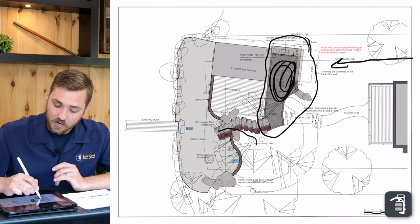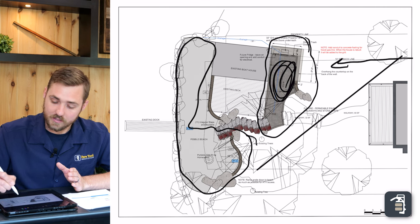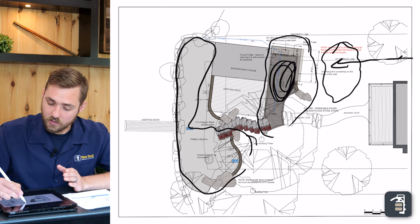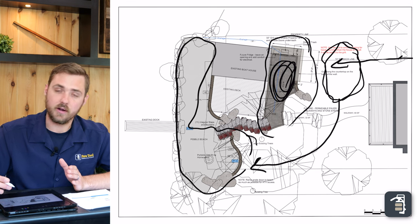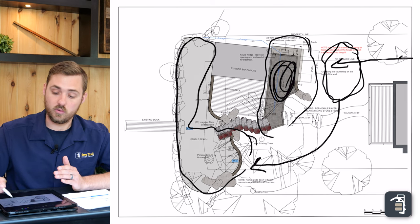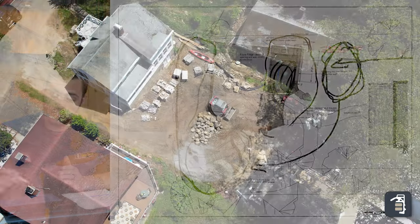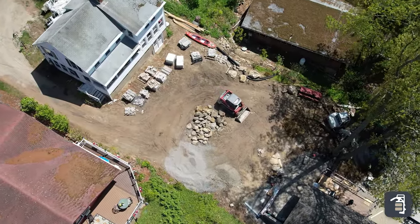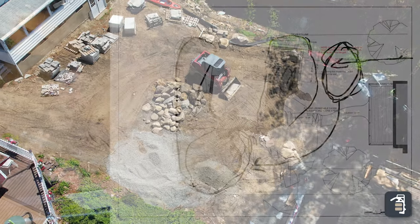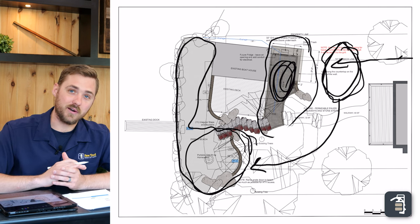Now for this area down in here, that's a little bit of a different story. We couldn't get the truck to make the corner and get back down in here. So what we did was dump that material right here, then transport it from here down to there. That cut our travel time from two minutes all the way up to the road down to just one minute — we cut that time in half. Minutes are money, and that goes to our bottom line. The more efficient we can get, the more money we make. The way to get more efficient is to plan this stuff out ahead of time before you start excavation.